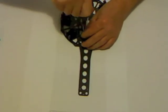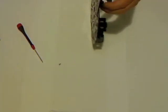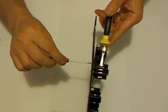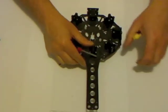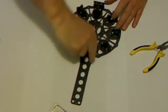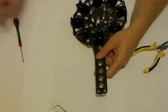And that's fine, because what I'll do is I'll just lift the block back up a bit, just enough that I can sneak in with a small pair of pliers and hold the pin while I tighten the screw. Now I've still got that block in place on the pins, holding the pin in place. There it is, nicely snuggled up. Okay, and pop my little 5mm back into place, just to hold that block in position. Okay, done.